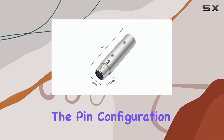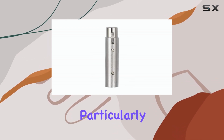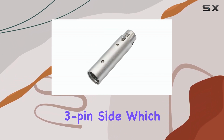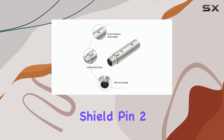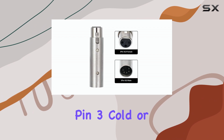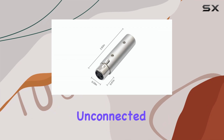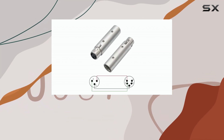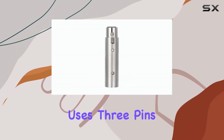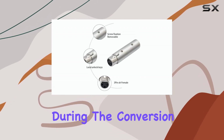Looking at the technical side, the pin configuration is straightforward and follows the standard for this type of conversion, particularly for DMX. It connects pin 1 on the 5-pin side to pin 1 on the 3-pin side, which is ground or shield, pin 2 to pin 2, hot or signal plus, and pin 3 to pin 3, cold or signal. Pins 4 and 5 on the 5-pin connector are simply left unconnected, which is correct for DMX signals being passed to a 3-pin connection, as DMX only uses 3 pins for the data signal itself. This ensures the signal integrity is maintained during the conversion.